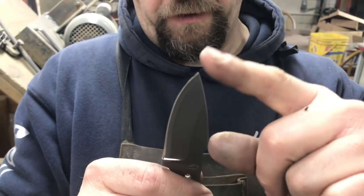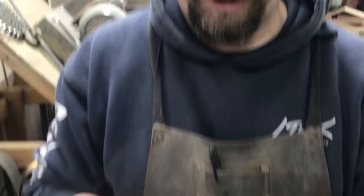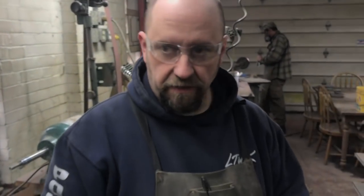I'm not pressing very hard — all I want to do is change the scratch lines, but I've also sharpened up this tip. If you take your finger and do this very gently, now it's like a needle — grabbing my skin, it's like a little needle. It's really sharp. The belt I used on the 2x72 grinder — this is another little secret — we only use a worn-out 120 grit belt. It's a happy medium between a variety of grits; being worn-out it's a little softer than 120, but it still has a stiff back so it doesn't flex much and doesn't divot the knife. Works out really good.